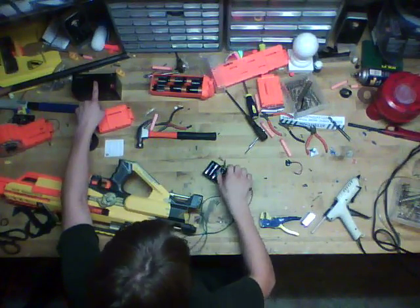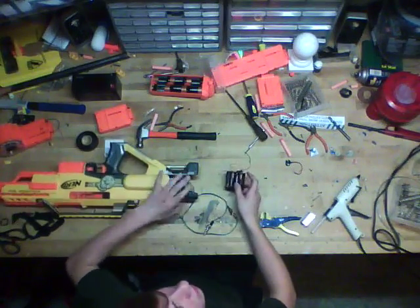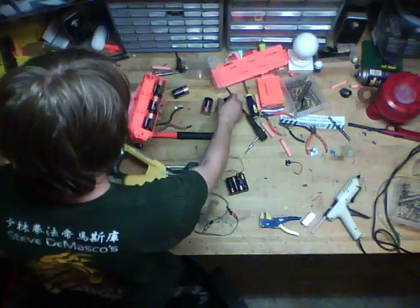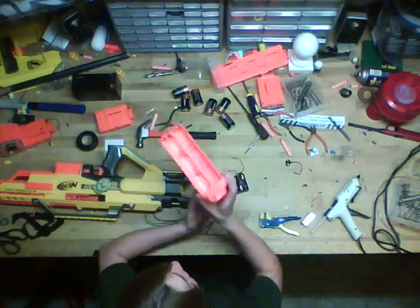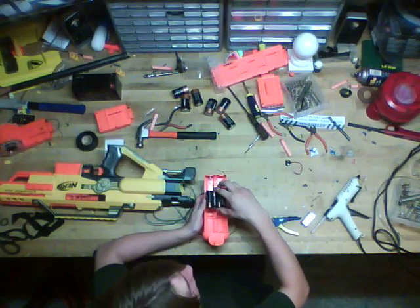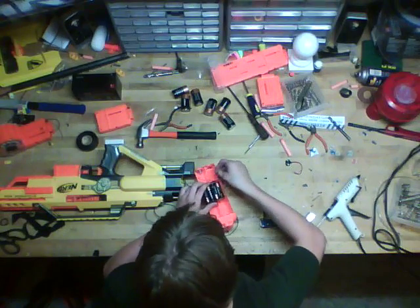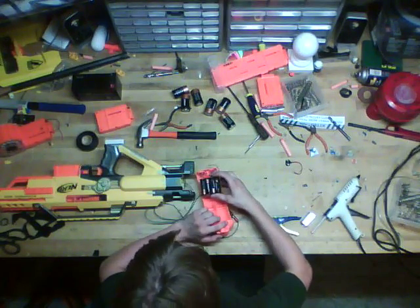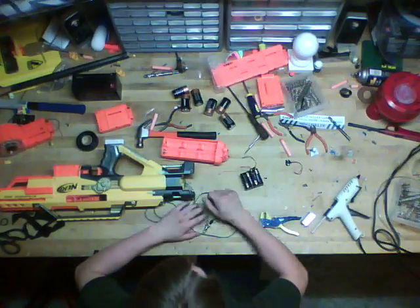It's not quite as fast as this, but it will be when I fully recharge all the batteries. How do you get this in here? The way I'm doing it — and I will give you step-by-step instructions, just not right now, so here's an overview — is taking this, cutting out these three plastic pieces, and putting that right there in its place. From there, the wiring is elementary: the red wire goes here, the black wire goes here. I'm going to solder them there, but I'm going to leave it so I can still open it and remove the lower batteries, so I'm going to create a clip system. That increases the voltage and makes it much lighter weight, which is easier to handle.